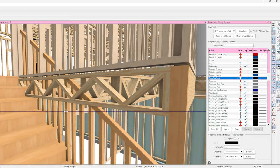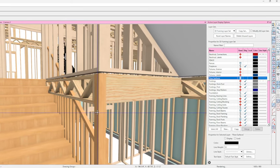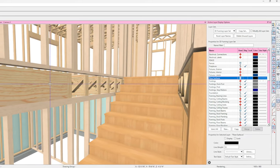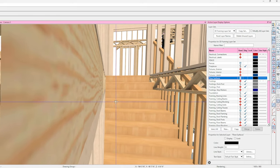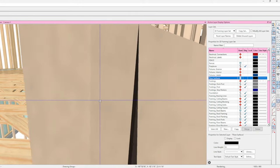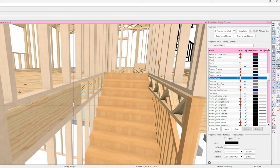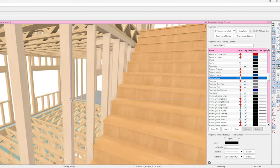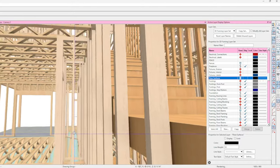I can't get the stairs in Chief to cooperate — I'm working with a guy in tech support to figure that out. Obviously the railing will not go through there to have the posts located where I want. You guys can decide if you want to block all the way through, run the trusses up to a rim for stability, or have the trusses run to the edge of the board and then block between. This is an interior wall so we're not worried about insulating — we just need to get drywall across this void. This wall up here is load bearing, so it's going to transfer load down through from the floor system crossing above.